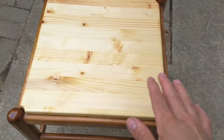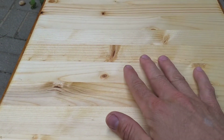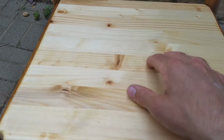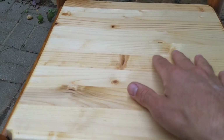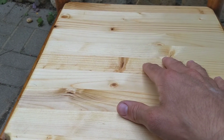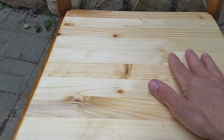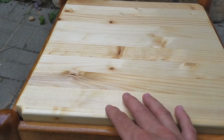Seems really smooth. I definitely have been watching a lot of woodworking things and guitar related videos lately, and I'm pretty sure I could have got a smoother sand if I had done a light raising of the grain with just some damp cloth before I did the oil application. So when I did that, there was a little bit of fuzz that came up, but it's still really pretty smooth, and I'm happy with it, and I didn't really feel like doing any more work with this.